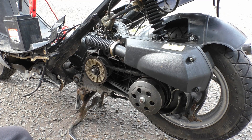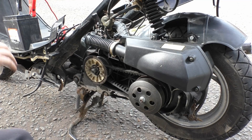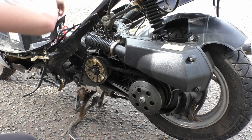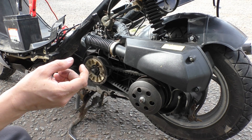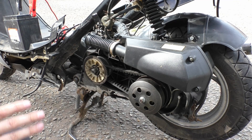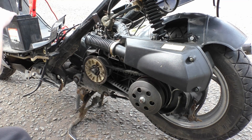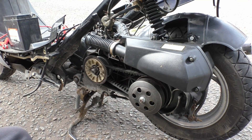Every time I come to this thing something else goes wrong. First, you can see there's a big battery — it just collapsed on me. It was at 12.6 volts and I found out why: one of the main fuses is loosely connected, so it's been arcing for ages and killed that battery. Then I had to get my reserve battery out and charge that, which was a pain.